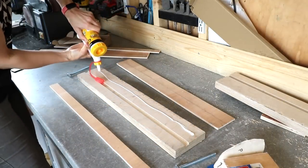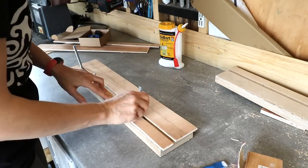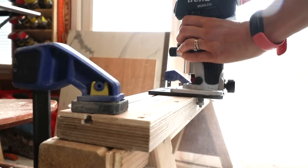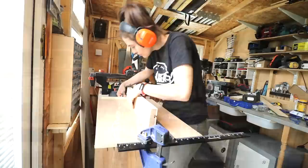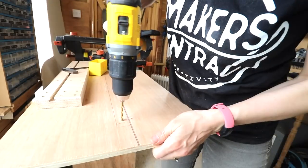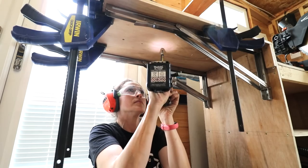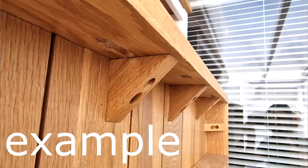I just want to explain a mess-up to prevent any confusion. I initially decided to cut one section a little bit shorter so I'd be left with a notch for sawdust build-up — that would have been fine if I hadn't got them the wrong way around, as I wanted the rail towards the top. You could cut them both wider and come back with a flush trim router bit, then use a chamfer bit. I trimmed off the top edge making it all level. Once I'd sorted it out, I lined it up with the T-square, making sure the square doesn't go under the chamfer edge, and drew along it at the back. I drilled slightly bigger holes than the screws so when I come to clamp and make sure the fence is square, the screws will nip it tight. I purposely used plenty of screws instead of gluing, in case I ever wanted to replace them. After my other pull-out brackets turned up, I repeated for the other side. If you decide to use a thinner wood for the fence, you'll probably need to add some triangular supports at the back.